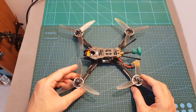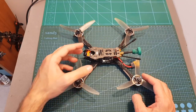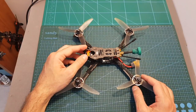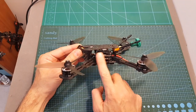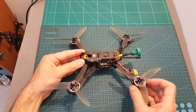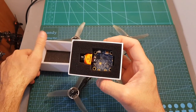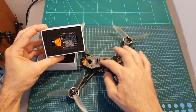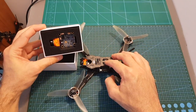In terms of flight time, I could get around 4.5 minutes using a 4S 1500mAh LiPo battery, and when the Runcam 3 was mounted on top of the Pika, I could get about 3.5 minutes. Another nice advantage of the Pika is that it has some extra room on the center, so what I'm going to do on one of my next videos is to add the Runcam Split 2S, which I've recently reviewed, but still they didn't test it on the quadcopter, so I think the Pika is going to be a good platform to edit, and soon I'm going to post some flight footage.